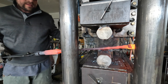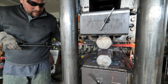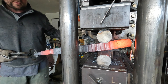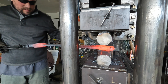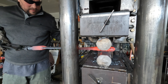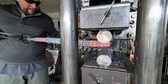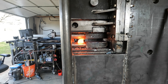You can see some of the problems already with the threads on the end - I should have just ground those out and that material would have drawn out nicely. But those ridges in the threads, if they don't get drawn out properly, get folded in on each other and there's scale trapped in there. I could have used flux and really heavily fluxed up the end at a hotter temp.